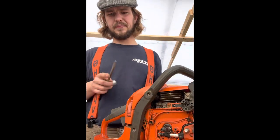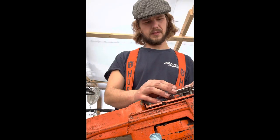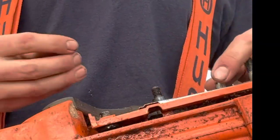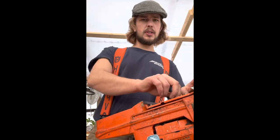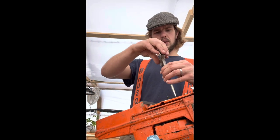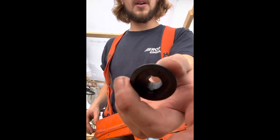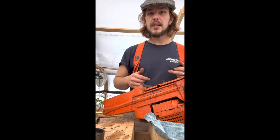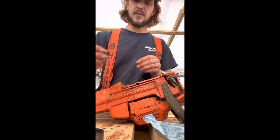She's not perfect but she's a lot better than what she was. The cover plate goes right back around where it came from — screw goes in the hole. Now here's our new worm gear — nice compared to the old one. So next time you think the chainsaw is not cutting good, dig a little deeper into looking at the chainsaw versus just trying to sharpen the chain. It's super simple. Our new bearing goes back in there.